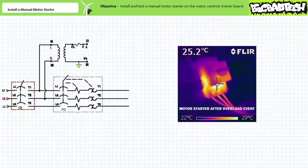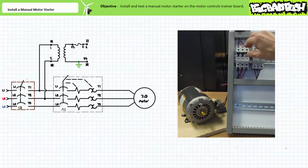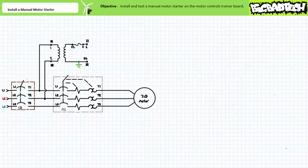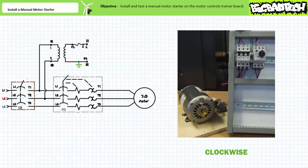I've got a reasonable degree of confidence this manual motor starter does what it says it can do — notably make or break connection to a motor and protect the motor from sustained overload conditions. The output of the manual motor starter is wired to a three-phase AC motor. When both the circuit breaker and the manual motor starter are closed, the motor rotates. When the manual motor starter is open, the motor free spins to a halt. No direction of rotation is fixed for this application; one must manually swap a pair of hardware connections to the motor to change direction. When the system is locked out and tagged out and L1 is swapped with L2 and returned to service, the motor rotates in the opposite direction when the manual motor starter is closed.